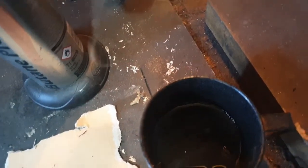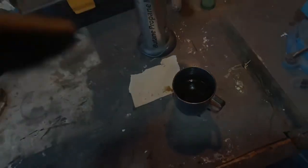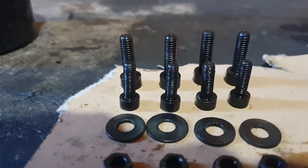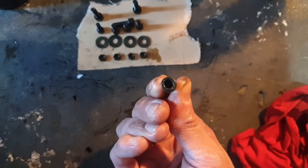We'll leave that for a few minutes to cool down and then drain the oil off. So this is what we're looking at now — this is also known as chemical bluing or metal bluing. If you look closely, there's a varying degree of bluing and I'm not sure if that's down to the heat. This process also works with spring clips, hose clips and stuff like that — anything really, you just have to clean it off first. It's worth a little experiment anyway, so if you've got any old bolts you want to clean up, this is how you do it.